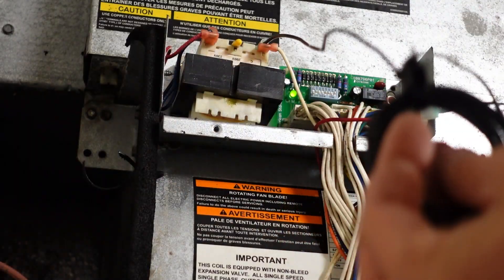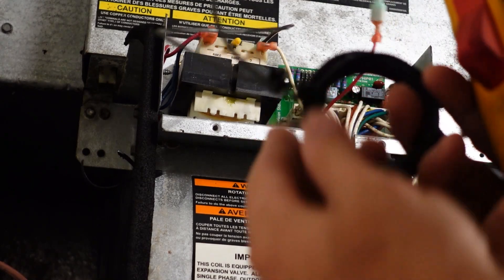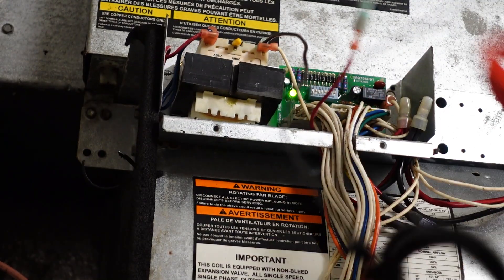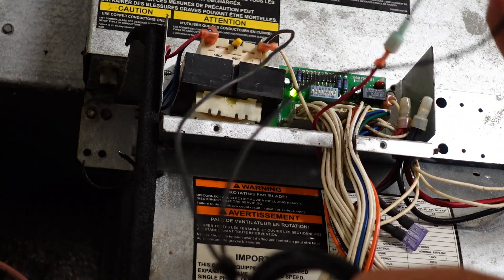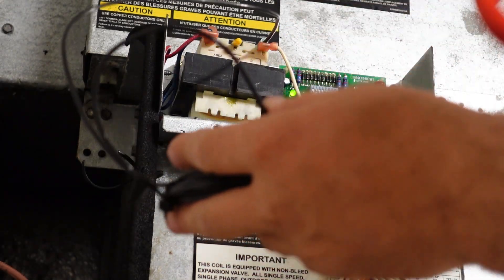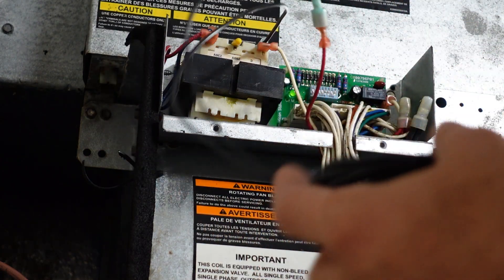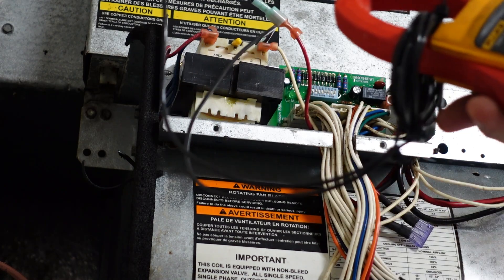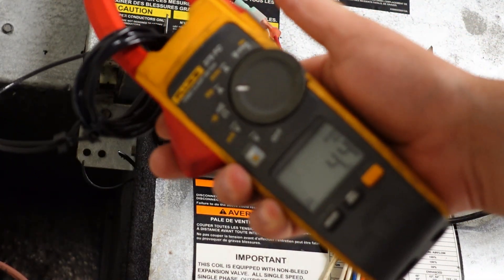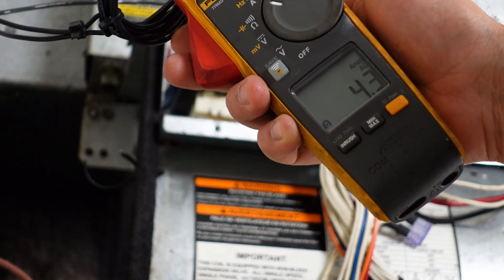I'm going to get this unit opened up and hook this up to show how to take a measurement with it. We have our 10-wrap plugged onto the transformer in the place of where this red wire would normally plug in, and we have the red wire plugged back into our 10-wrap. The most common connection I keep on this 10-wrap is a female spade connector and a male spade connector, because that's the most common things I would use it for.